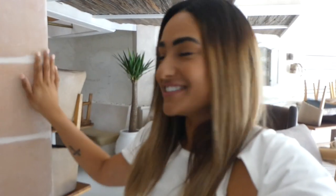These poles were previously PVC pipes covered in rope. They are a real focal point in this restaurant when you walk in, and in order to give it that real Moroccan look, they rebuilt a timber structure — a square column around this — and then it was tiled with terracotta tiles. The secret to getting them looking whitewashed like this: when the boys were applying the grout, I got a sponge and started to rub the grout all over the tiles. Everybody was like, what are you doing? But that is what gives it that whitewashed look and makes it look like it's been there forever.